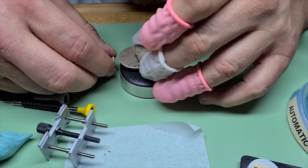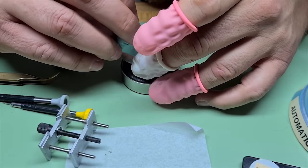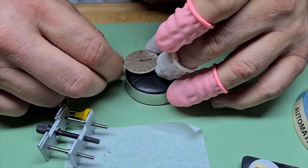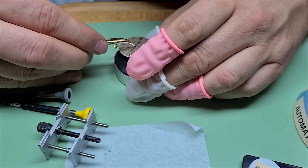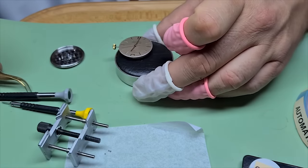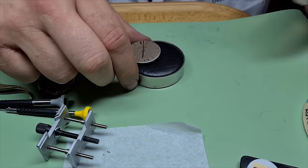Once we are happy, then it's time for the minute hand, which we do exactly the same thing for. The hand setting tool might leave a few marks on the hands, so we can use some Swiss Play-Doh to take that off. Then the second hand as well. Turn the hands through 24 hours — make sure the hands are at midnight or very close when the date flips. The minimum standard requirement is that the date flips between 15 minutes to and 15 minutes after midnight, but we should be able to get it within five minutes. It is actually one of the first things that a customer will check when either buying a watch or having a watch returned from service — that the date flips at midnight. If it's 15 minutes before or after, that will be a little bit of an issue. So let's stick to five minutes.